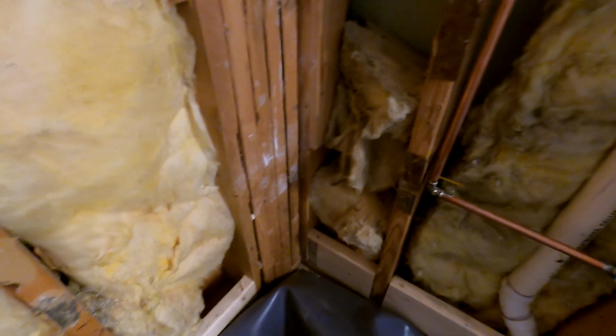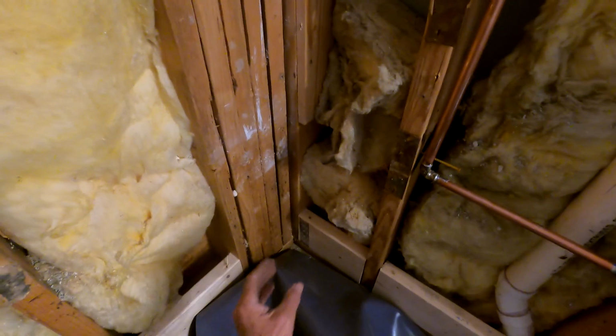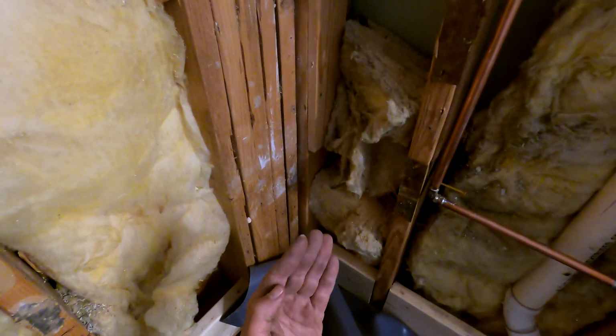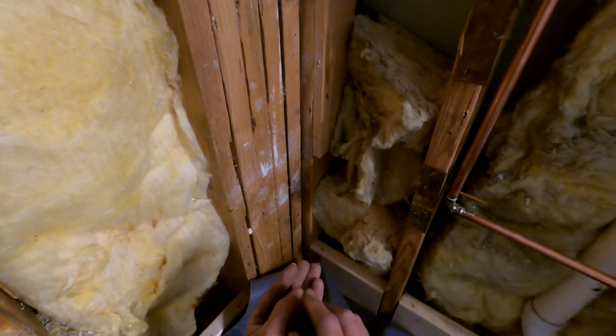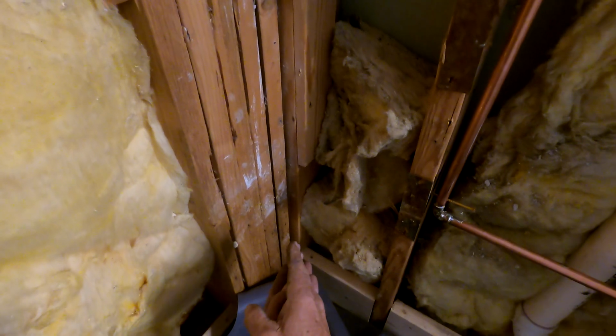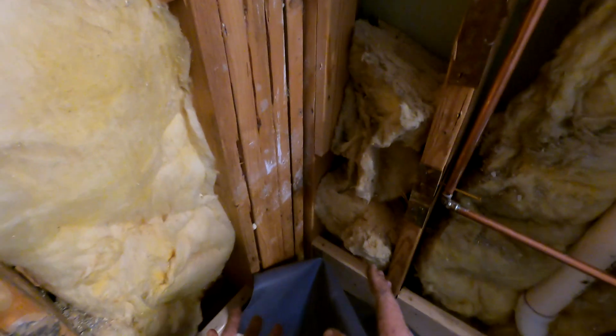I've never felt good about it, even back in the day when I was first doing pan liners and I would notice that gap, it's like, you know what, let me shove my liner back in the gap. But then I feel like the liner is going to drop down, and if there's a half an inch or three quarters of an inch, enough room for a liner to get in, I feel like the mortar could kind of follow. It just never felt right to me. So you could do it, and it would prevent the bump out that we always are going to have. But like I said, 98% of the time there's not going to be a gap there to deal with anyway.